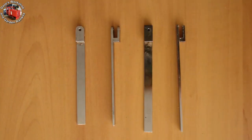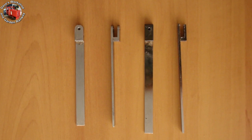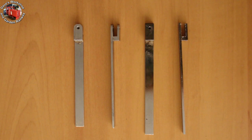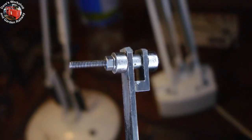The ends have been brazed on and one has been slit one eighth by three eighths deep. Both were drilled 1.8mm for 8BA tapping first. Under the magnifier: quarter inch filing buttons ready for rounding at the end. This is the best way for the buttons — on the outside of the job.